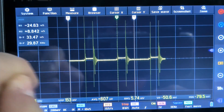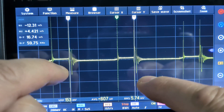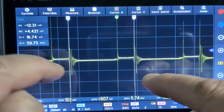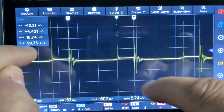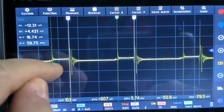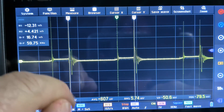That's probably the power converter. The way these chargers work, they have an oscillator that pulses through an inductor into a capacitor, and they vary the frequency of the pulse depending on the load to keep the capacitor charged to five volts — and that feeds your output. So we've got a 60 kilohertz signal, and we could multiply that by two, three, four to look at the harmonics and figure out exactly where the noise from this adapter will fall.